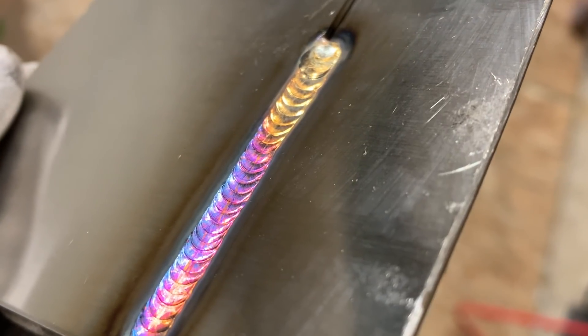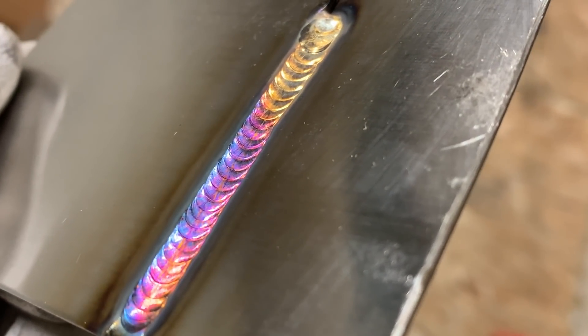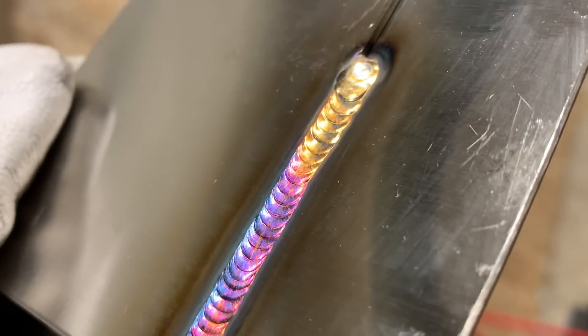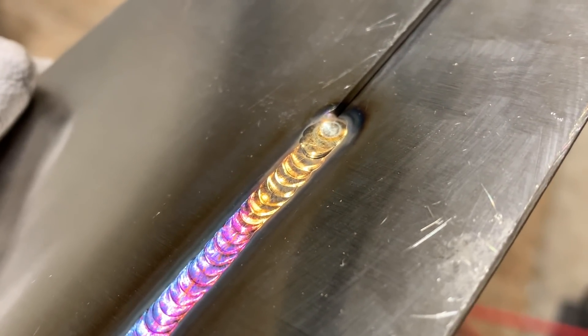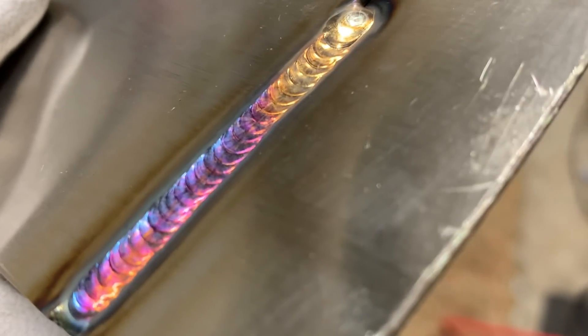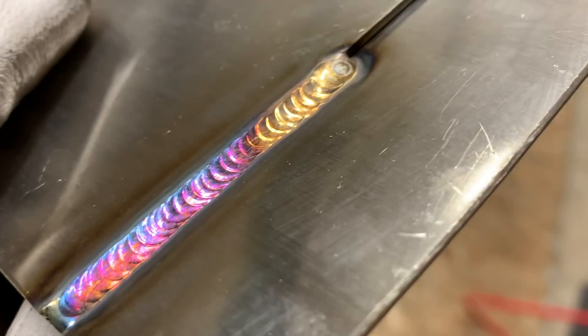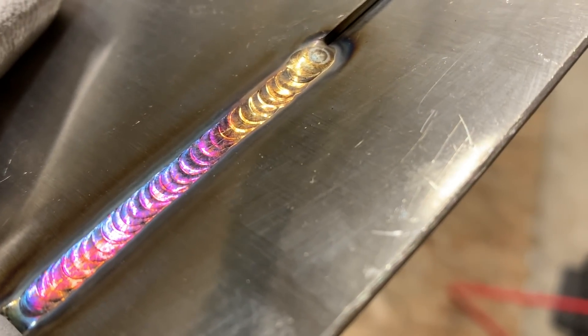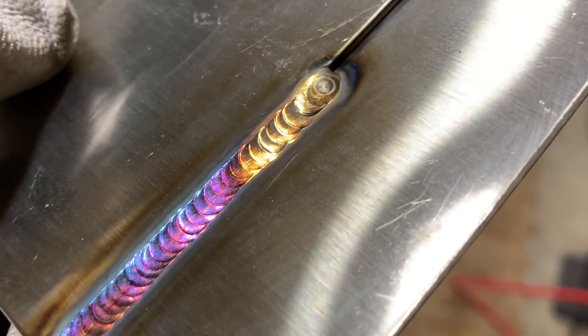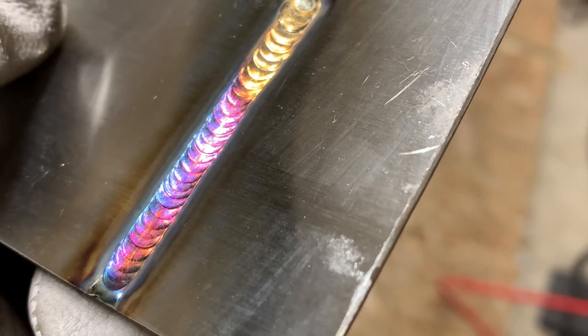Okay, so there you go. You can see it did color up a little bit too much for my liking. However, this material is super thin so obviously it's going to be a little tricky to keep totally cool. The color we're shooting for is more towards the gold type color at the end there, but I do love the look of that blue and purple — that is really nice to look at. For the second half, I'm going to switch to a bigger cup and add a little bit more filler rod and try to keep it from overheating. I was only using a squeak on the pedal there, so very light on the amperage overall. The consistency is decent and we'll see how the second half goes.